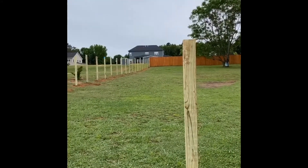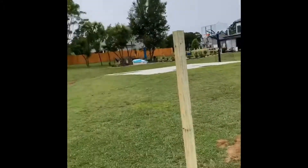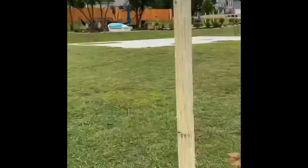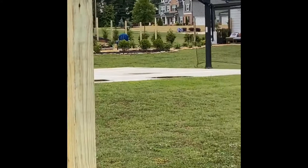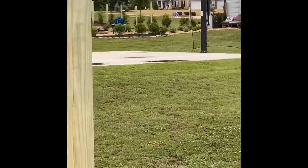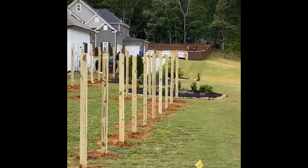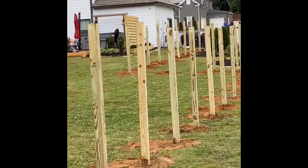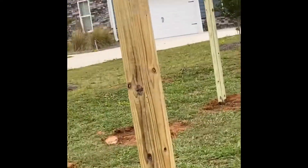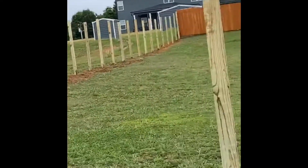That's a little bit less on materials because you don't have the framework that you normally see on vertical fences. You don't have the frames on here, so you don't have that support, but since the pickets are running closer together at six feet apart, they're able to handle that span. So every six feet.